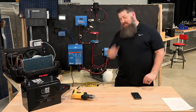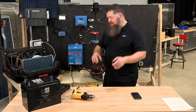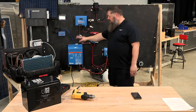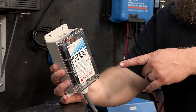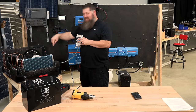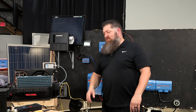What we're going to do is attempt to run one air conditioner off of one Big Beard battery. One important thing: anytime you do solar using an inverter with a roof-mounted air conditioner, you definitely need some type of soft start. The soft start eliminates the inrush from that capacitor. There's a video we did on soft starts for more information.